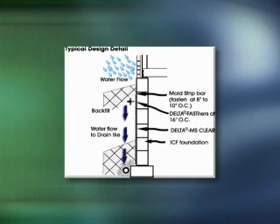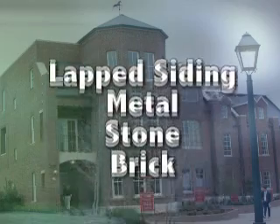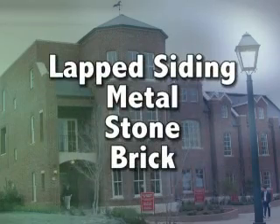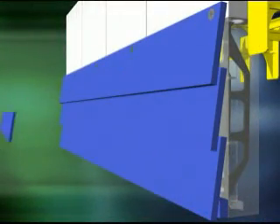Cover exposed areas of basement walls with a one-step stucco or other compatible parging material. Most common exterior cladding systems are compatible with QuadLock walls. Exterior finishes including, but not limited to, lap siding, metal, stone, and brick can be screwed to the recessed plastic ties or to the plastic fastening strips in the QuadLock FS panel. Local regulations may require a rain screen, which can be provided by fastening wood or metal strips to the exterior of the building.